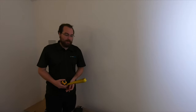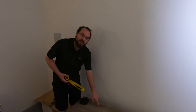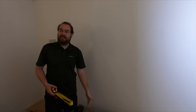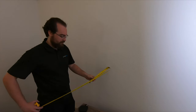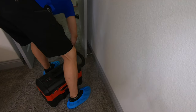Alright, so I'm out on the TV here. We want it to be a specific measurement — we want 14 inches off of this entertainment center. So I've measured the length from the bottom of the TV to where the top of the mount will be, and I've added that to the 14 inches. I've gotten 31 and a half inches. I'm gonna mark that on the wall and that's where the top of our mount will be. The Dream Media difference guys — we never leave your house dirty no matter how big of a mess we make.